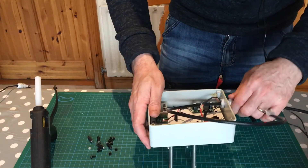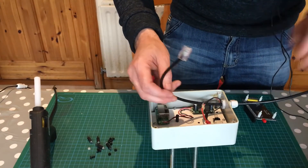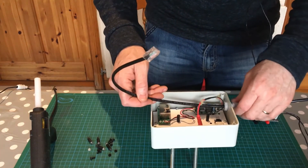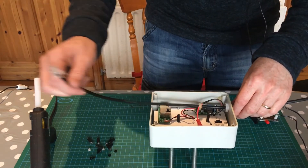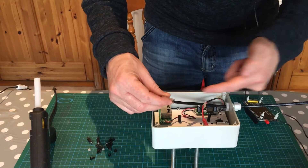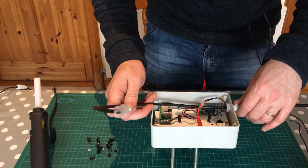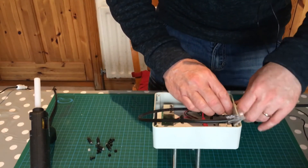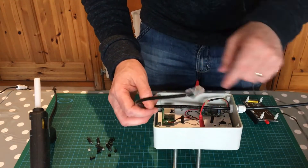This is the pre-made cable I've used for the power over Ethernet. I mounted two cable glands in the box — one on each side — which allows me to pull the cable in. I put on the Ethernet connector after pushing the cable through, because the connector is too big to fit through the gland. I'll leave it loose for the moment so I can adjust how much cable is inside the box.